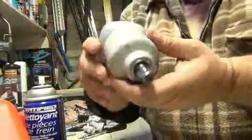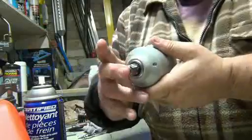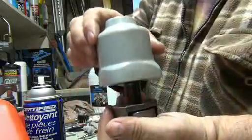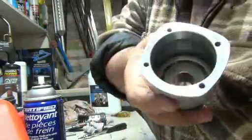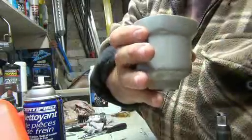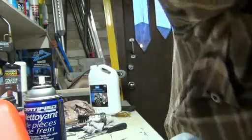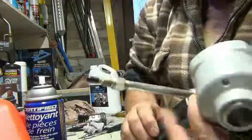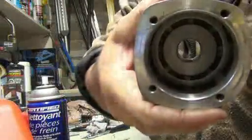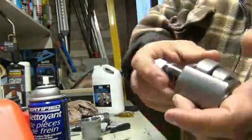Now this is the front of the gun. Alright, so the impact housing really. So now we're going to pull that out. There's no clip, there's nothing to hold this together. So just gently pull that out. Alright, you can clean that out. And it's kind of hard to do because this is where the grease is. There is some grease in here. And there's a little port here for greasing too, with a needle and a gun, something similar to this, with a needle. Right? Yeah. There. So this is all clean too. Alright. So then we have this.